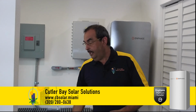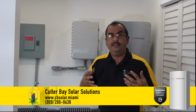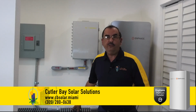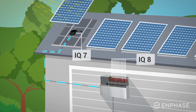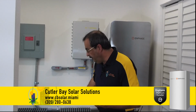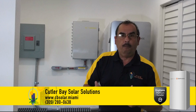The main difference with the Ensemble In Charge battery is that basically what islands your home, what separates the home, is the technology behind these microinverters. The microinverters IQ8 are on the grid and off the grid. So the microinverters are actually talking to the inverters that are running your home and allowing your panels to turn back on. For every In Charge 3.3 that we put on your home, there's an equivalent amount of panels that you can have on your roof that are going to turn back on.